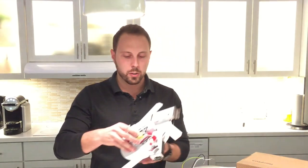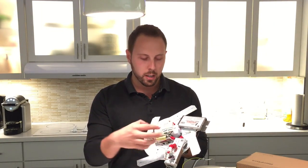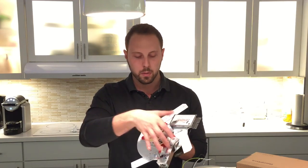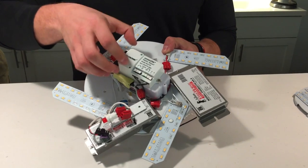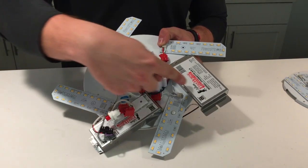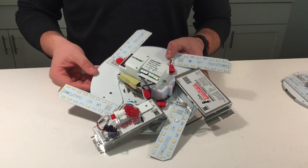This unit is also an LEDCR — this one has all the bells and whistles. It has both the integral occupancy sensor and a built-in emergency battery backup system. There are a lot of fixtures out there that may have had a Bodine backup system or were working off a generator. This one unit is going to totally replace whatever was there for emergency or generator backup power — all in one.